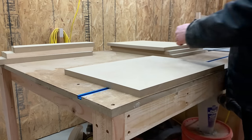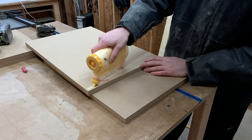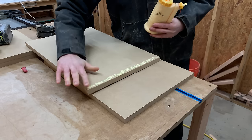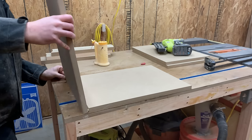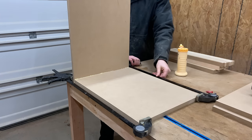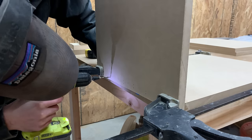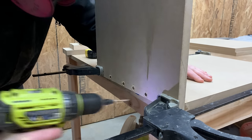Construction of the box is super easy but you have to take it slow and make sure that you're building it correctly. I grabbed two side panels, spread a little bit of glue on them, lined them up with the other board, and held everything tight with some clamps. The glue would be pretty strong, but just to make sure we threw in some screws — so I pre-drilled and countersunk some holes before coming back to drive screws in them.